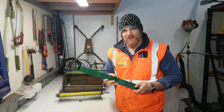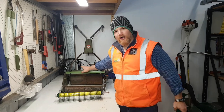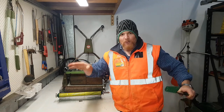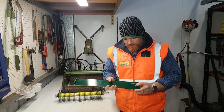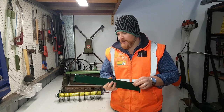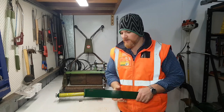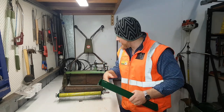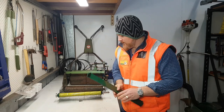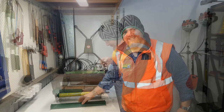The kit also comes with a dummy sole plate. This has a few functions. The first being it's there to supply rigidity to the frame — by removing our initial sole plate it could get a little bit wobbly, so that's what this is doing. It also has locating lugs for our deflector plate, which helps channel all of the muck and stuff we dig out of our lawns towards the catcher. And it's also solid the whole way through so that it stops deflecting stuff into the rear roller. Happy to get that installed.